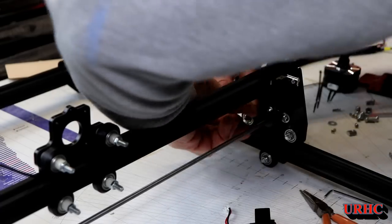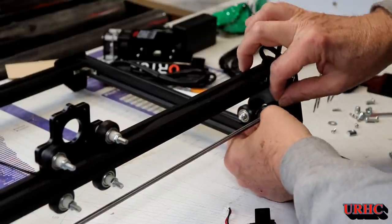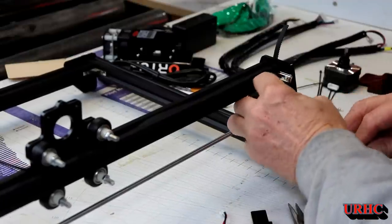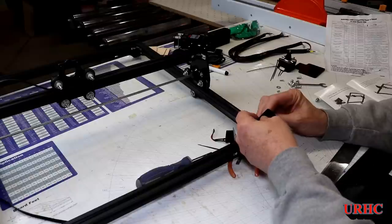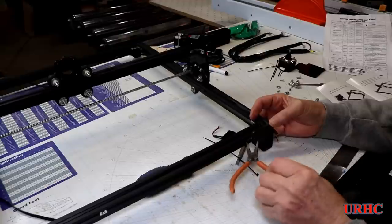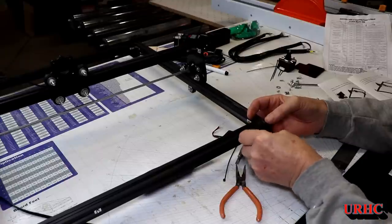The two back brackets are basically the same, just opposite. You have to make sure you get that belt started through the rectangular slot. On the front side, the belts have to be pulled under the first wheel, go up around the gear on the motor, then get pushed back down into the slot in the channel and stretched out to the front. I found it's easiest to do this with a pair of long-nose pliers to grab it and pull it through.